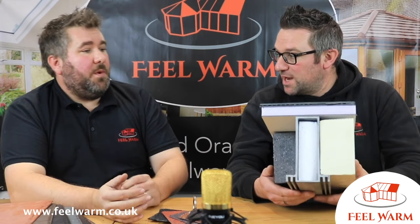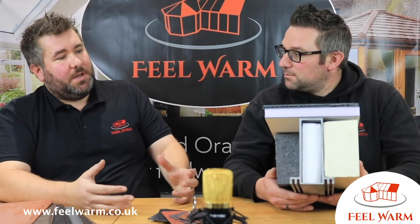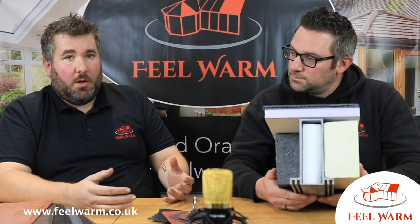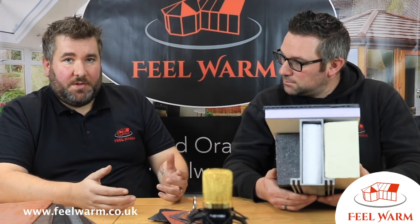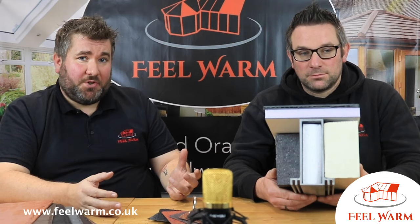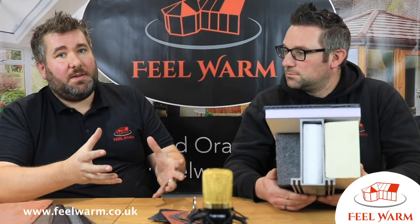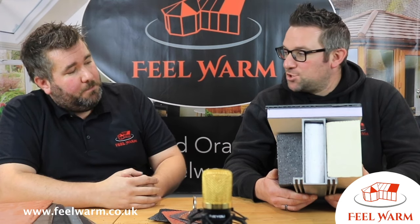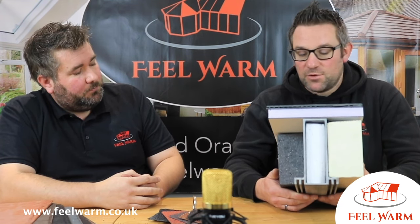We've seen that in the past with roofing systems that incorporate timber, particularly in the winter when installations are being done and it's cold and it's wet and it's raining, materials are getting wet, and then that water that gets trapped in that timber after the installation's done, after the plastering's done, will seep out of those timbers whilst they start to dry. Yeah. And you'll get those damp patches on your plasterwork, and they'll need retouching, they'll crack, they'll need dealing with. It'll all just stay in there trapped, and then eventually it'll start to seep its way out as things start to fail and give you a problem down the line.